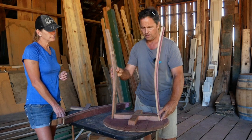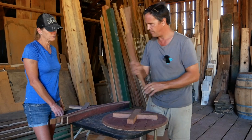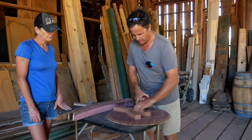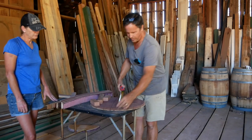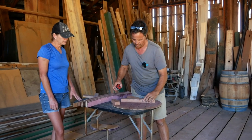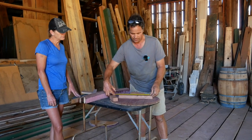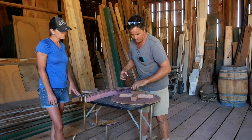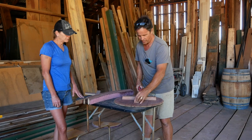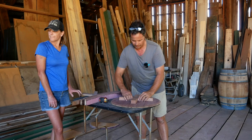That little angle means it's a much more cosmetically appealing result. Let's do some measurements — this barrel head is 22 inches across, and they vary a little. I've made this cross piece 14 inches, and this one is just one piece cut in half with a gap, also 14 inches. We're going to glue and screw that to the base so that it's permanent and structural.